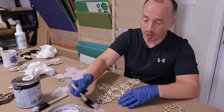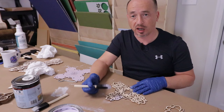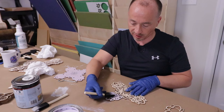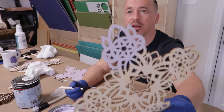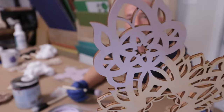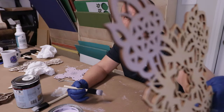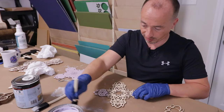What I recommend is dabbing off all the excess on craft paper here, work it into the brush, and then wipe off the excess. Then with light pressure, just rapidly brush across the surface until you get the color on there with no dry spots. You don't want to press down because you're not trying to squeeze it out of the brush onto the surface — if you do that, it's going to load up in those surfaces. So do light strokes, switch it, kind of angle your brush like you're dragging and slowly smoothing it over. You can see on this piece right here, I've been coloring that. I like having the unpainted insides because the burned areas, once sprayed with lacquer and they turn dark, create contrast. But if you get big globs of stain in there, it's going to look unprofessional and detract from the effects. Just FYI.